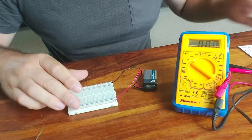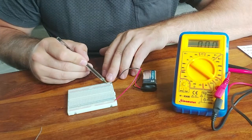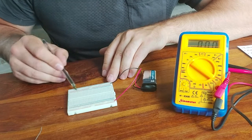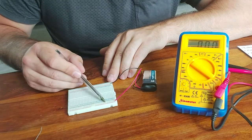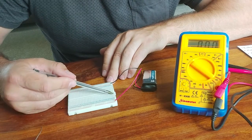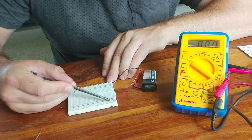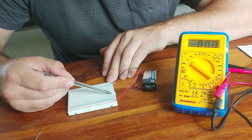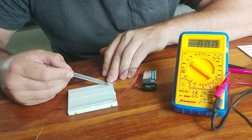So in this breadboard, you can't see it, but underneath this plastic we have some horizontal copper tracks, and we can push wires into these holes to connect to the copper. So we have two horizontal ones here, which is separate, two horizontal ones over on the other end, which also conduct horizontally, and we have lots of vertical copper tracks. There are gaps, so there is a gap between the horizontal rails at the top, and the vertical ones conduct this way. There's another gap in the middle, then another one which conducts, and another gap here.